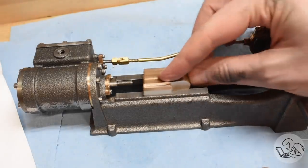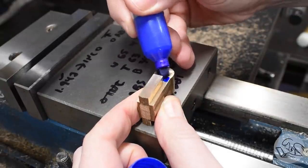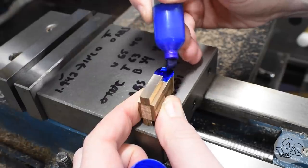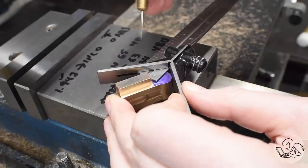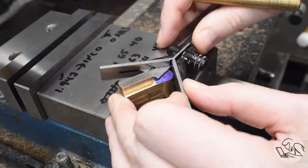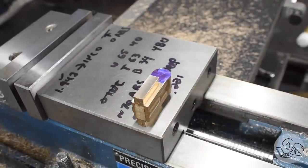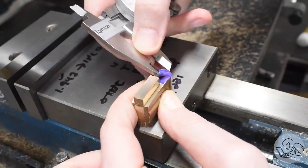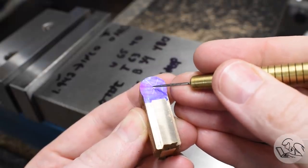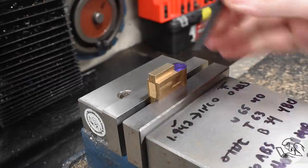The reference datum for a bunch of upcoming features is the bore through the clevis, so I'm going to do that next. On the X-axis it's really just aesthetically centered on the casting. On the Y we can reference from the legs, so I've got my center finder tool in there making a few marks, using the round casting as a reference, and sanity-checking with my caliper from a couple of different angles. The casting isn't perfectly round so we end up with kind of a little triangle in there, and I'll guesstimate the center from that.